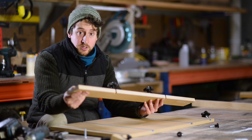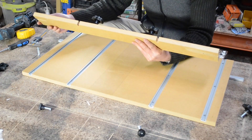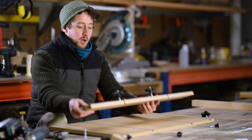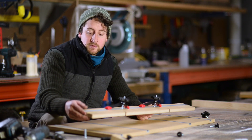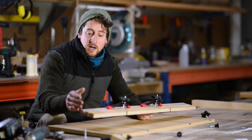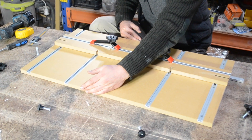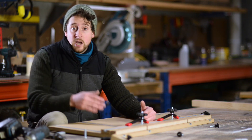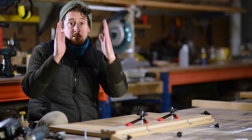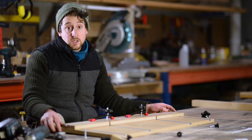The beautiful thing about this kit is that it's just so simple to put together — you just need some MDF, a couple of router bits, a screwdriver, and a drill. I'll go through step by step what you need to do and give you some rough measurements, but this kit is designed so you can create it in any size that suits your table saw. Mine is 800mm long by about 450mm wide, which is quite large for this type of jig, but I wanted to use it as a jointing jig on large chunks of timber. If a smaller size suits you, go ahead — you'll just have some longer off-cuts of T-track to use later.